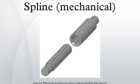There are two types of splines: internal and external. External splines may be broached, shaped, milled, hobbed, rolled, ground, or extruded. There are fewer methods available for manufacturing internal splines due to accessibility restrictions; methods include those listed above with the exception of hobbing. Often, with internal splines, the splined portion of the part may not have a through-hole, which precludes use of a pull/push broach or extrusion-type method. Also, if the part is small it may be difficult to fit a milling or grinding tool into the area where the splines are machined. To prevent stress concentrations, the ends of the splines are chamfered; such stress concentrations are a primary cause of failure in poorly designed splines.